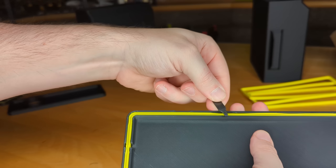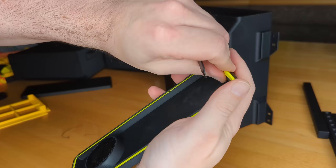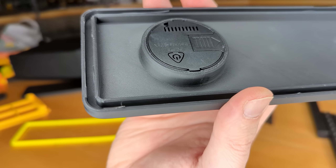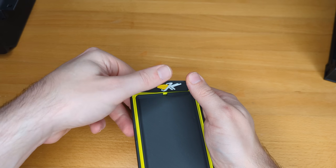Just when I was filming this part, I had a problem seating the lid for the first time, so here's a bit of troubleshooting. If you have a problem fitting the lid, double and triple check the seal alignment — are there waves which disrupt the slit? Use a flathead screwdriver to detach the seal. Inspect the lid for small bumps or loose layer lines and remove any impurities. In my case it might have been a faulty spool of filament. Then reseat the seal. If it remains uneven, use the seating helpers from this plate and press them in. Let it sit for a while for the TPU to hold the shape. This consistently resolves the fitting issues.